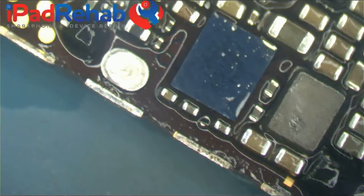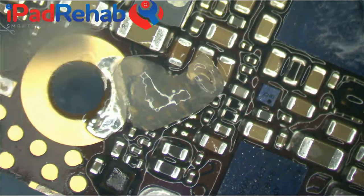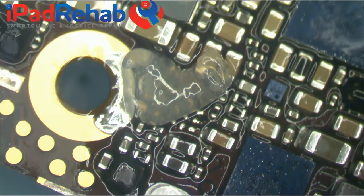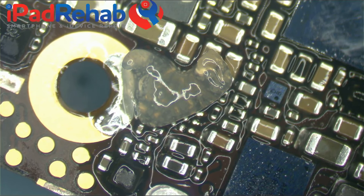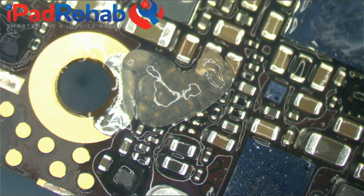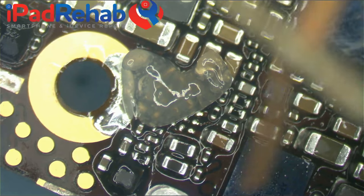Now this time, I'm gonna braid because I have a reason to braid. The reason that I want to braid is that I really don't want for D1 or D6, or whatever it is, that pad to have a little bit of solder on it that makes it touch the edge of the deleted ball. I want to have an experiment, and it depends on D6 not making contact with that pad. All right, so now we have a reason to braid.